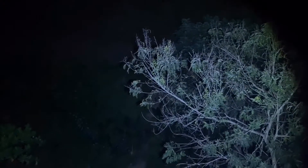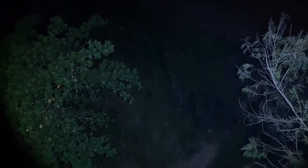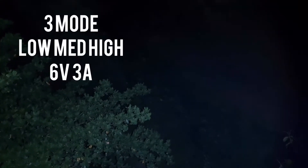So this Jaxman — okay, yeah, that's full power. It's XHP 50.2 cool light, LED emitter with Aspheric. So this is it in full flood. It's just a very even light as you can see. It's not lighting the valley as much — it can't quite reach there, or at least it lights up the tree more, which makes it harder to see. It's filling up the whole camera range. I swapped out the circuit, so it's just a simple three-mode low to high with the high being 3 amps.